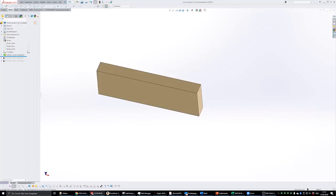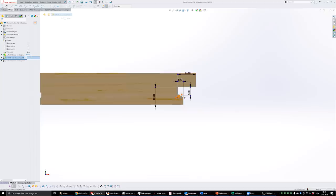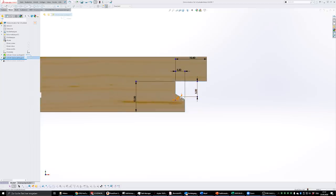Maybe it's a bit difficult to get your head wrapped around this, so I have prepared something on the computer where I can show you how the settings affect the final joint. This model is basically a representation of the piece of wood you just saw, and I made the first cut with the exact geometry I showed: five millimeters from the middle of the angled surface to the top of the cutter, 3.2 millimeters from outer to inner edge, 10 millimeters of bit height, and 10.6 millimeters for the fence distance. This will create such a cutout.